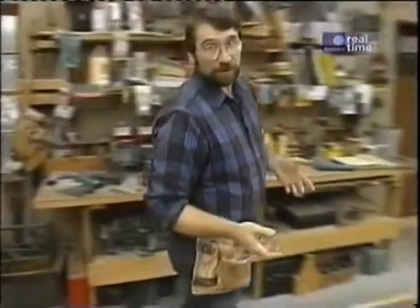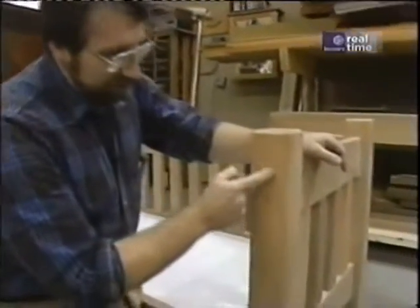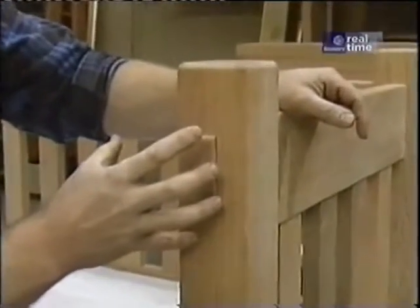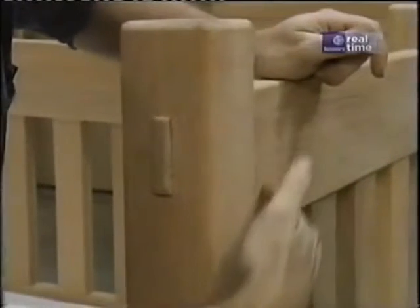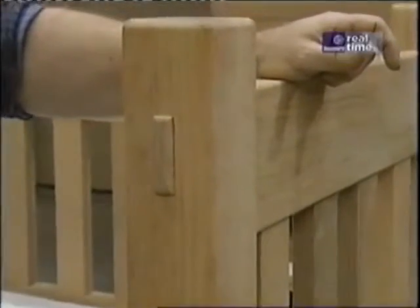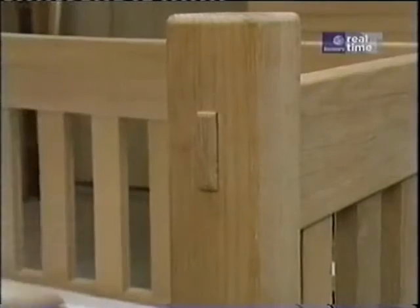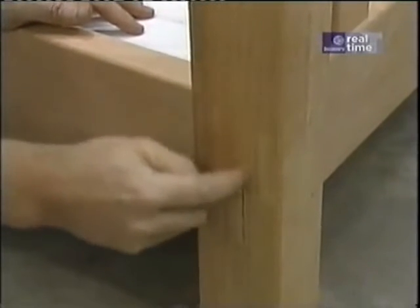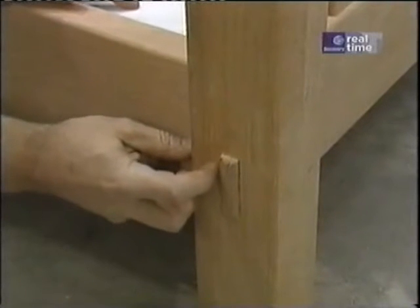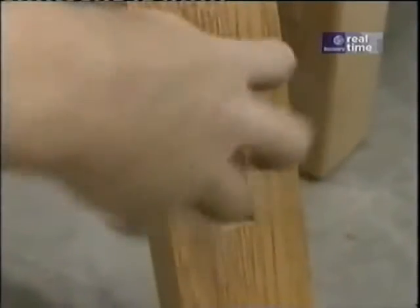I've been working on the final step of the mortising on the post. The mortises I made for the through tenons are certainly large enough, but the rails are five and a half inches high, meaning the bottom part of the top rail isn't really supported and could twist out of shape. I could have made a larger mortise for a larger tenon, but everywhere cross rails come in, the side tenon could only be an inch and a half long — and I don't think that's strong enough. So what I've done is enlarged the mortise to give me the support I need to keep those rails from wanting to twist.